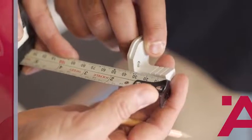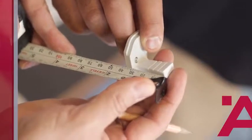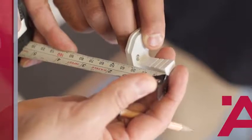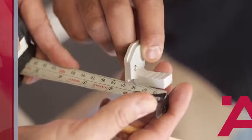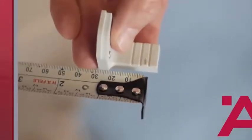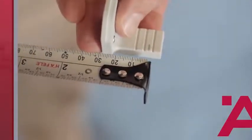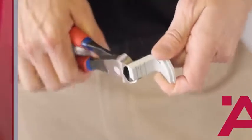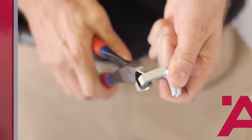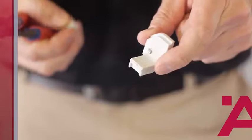We're going to deduct 10 millimeters from the height of this trigger so that we miss the top guide wheels and actuate on the soft-close mechanism at full length. Pretty close to right in the middle of that indentation is where that needs to go — right there — and we've got the part trimmed.